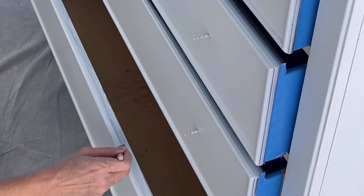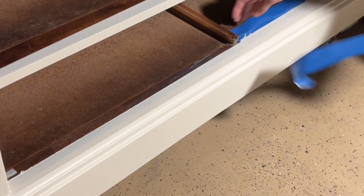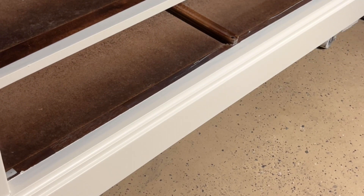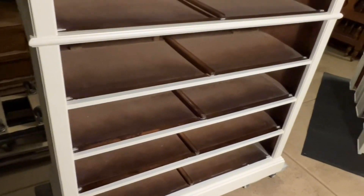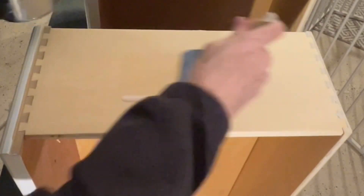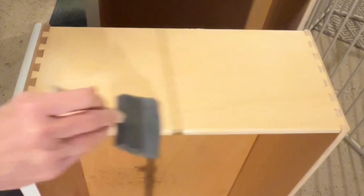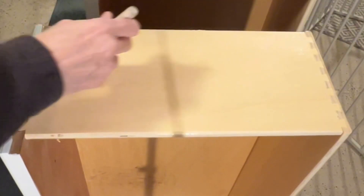I did my final coat of paint — I forgot to film that — and I also did my top coat. This is General Finishes High Performance Flat Top Coat, which is wet here since I just sprayed it. After the paint and top coat are dry, I went in and taped the inside of the cabinet just to get those fresh, crisp lines. I know they're underneath the drawers, but all the details matter. Here are those beautiful dovetails. These drawers came already sealed and top coated on the outside, but I sanded the dovetail areas, which left the rest of the drawer sealed and the dovetails as raw wood. So I went back in with my top coat — I ended up doing two to three coats just so it was a uniform color. They turned out fantastic. I'm super happy I did that. A lot of times I just use wax, but this was fun to do with top coat.